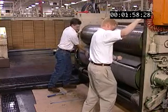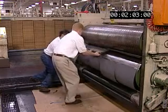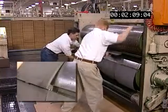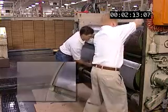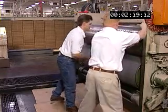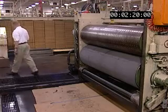Time-saver's lock bar promotes extremely fast blanket installation. A few quick hits with a dead blow mallet lock the Time-saver firmly into place without relying on the cutting die to complete the lock. As an added bonus, Time-saver blankets are reversible and can be mounted in either rotation direction. The full rotation of dual-width Time-saver blankets has been finished in under 2.5 minutes on an unmodified die cutter.